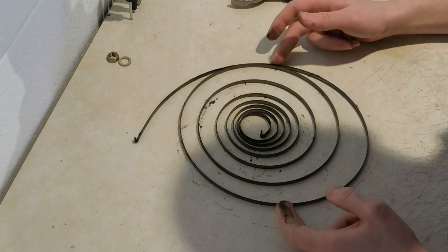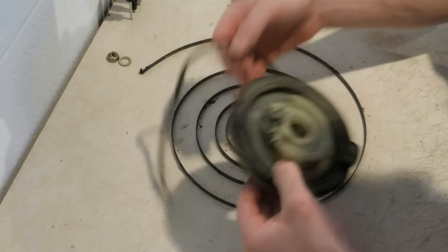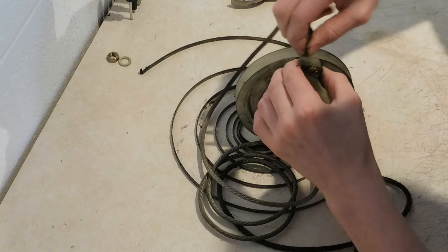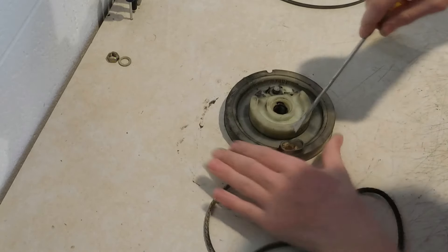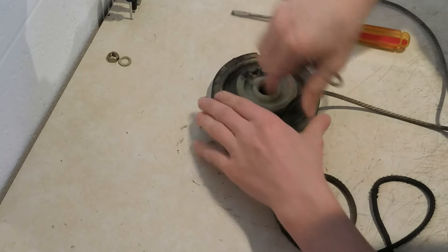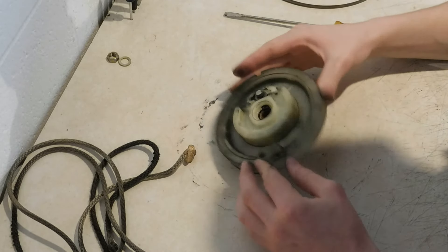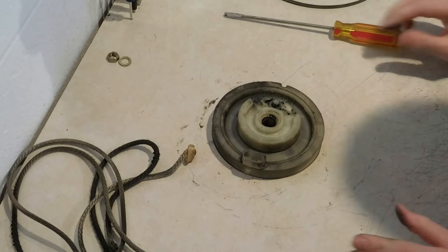Inside there'll be a thin plastic piece that goes on the bottom, just to keep the spring from rubbing metal on metal — we'll clean this up too. Here's your spring, it's all uncoiled. There's lots of ways to clean up your spring; I'm going to show you the way I do it with a nifty little tool. As for this wheel, you can uncoil the whole rope — I don't think I'll have to replace this rope as it looks in still fairly good condition. The knot at the end you can just pry out with a screwdriver to pull the rope completely out. There's the wheel and it doesn't look like it's been worn or beat up at all, so that's a good thing.